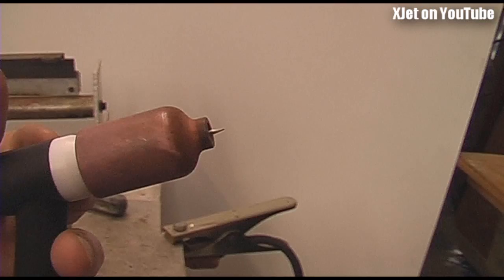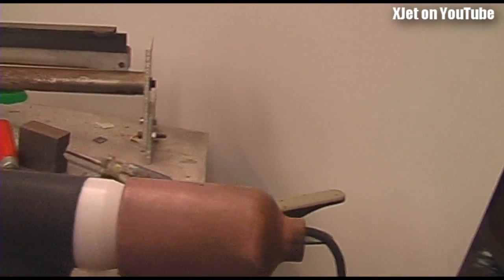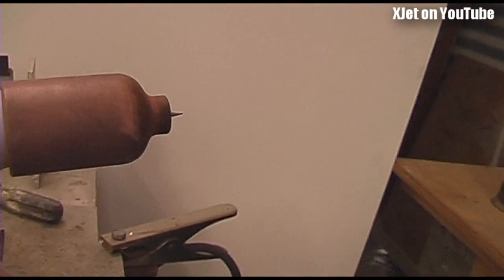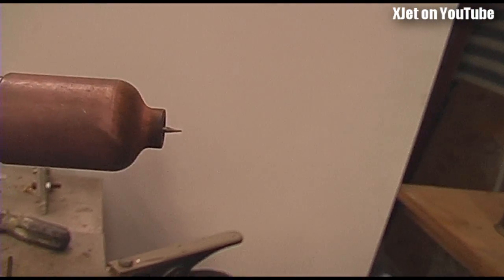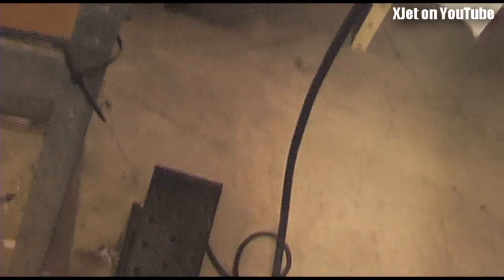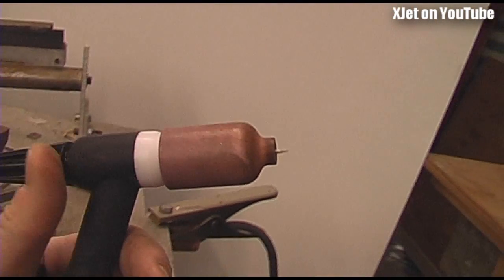This little tungsten tip has to be held very close to the work so that the arc is relatively short. You have to vary the current flowing through that arc to maintain adequate heat in the weld without melting the whole thing into a blob. To do that, down here on my messy floor, we have a foot pedal which I can operate with my foot - it's like a sewing machine pedal. As I push down, more and more current passes through the tip on the welding torch and the work gets hotter.